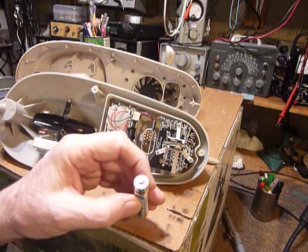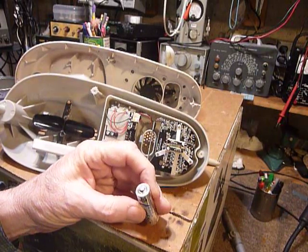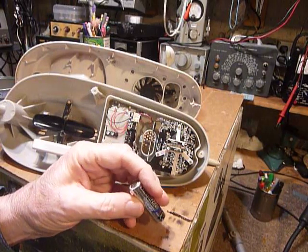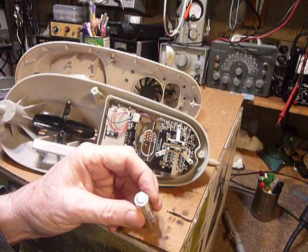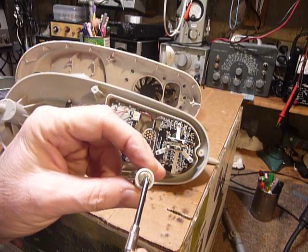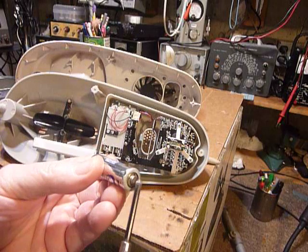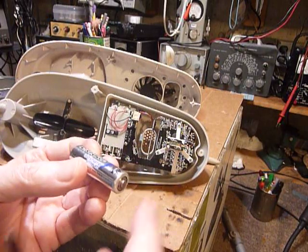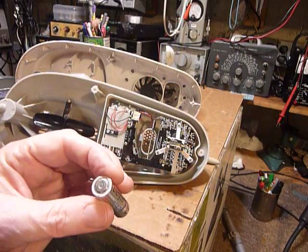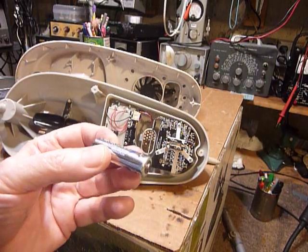And I've had several guys tell me, well, that grease is an insulator. Yes, it is. And it's also a very good dielectric product. It keeps the water out. So anything that makes a solid contact with this metal part of the battery, top or bottom, will displace the grease that you put on there, and you get a good contact, and the grease then remains and prevents water from getting in the future.